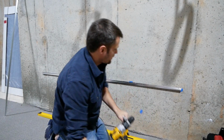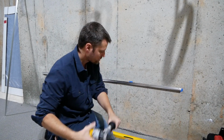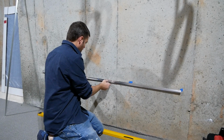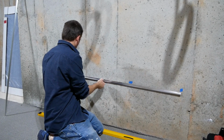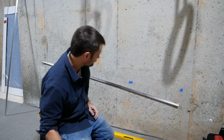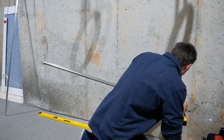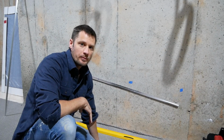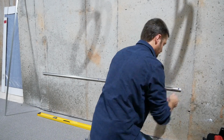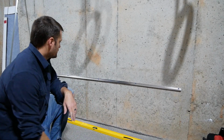And so this bit isn't going to fit through these holes, so we're just going to loosen this up a bit and tilt it to an angle. That should expose the marks, and then we can just go ahead and drill these out as well. Alright, so we've got them all tapped out. Now let's just put the anchors in. Okay, I've got those all snug in there.